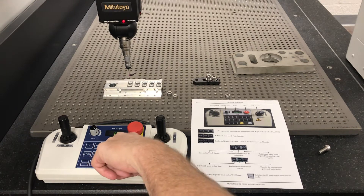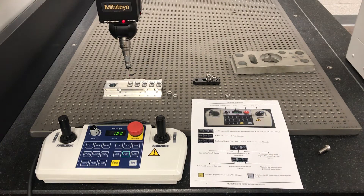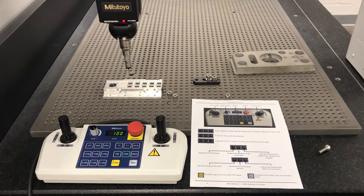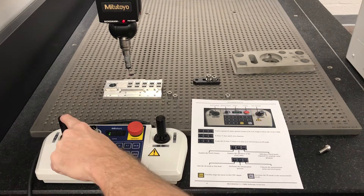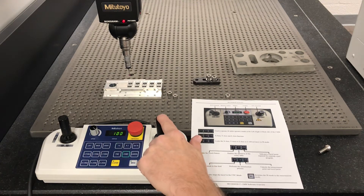This is the status window. As you can see on the sheet, it's got an E. Typically E's are alarm codes, but pretty much what we're going to use it for is when you see numbers, that means it's in rapid. If you press this, this, or this — all three of those put it into measure mode. You have a rapid mode and a measure mode. The measure mode typically says L. If you see L, you know you're in measure mode.